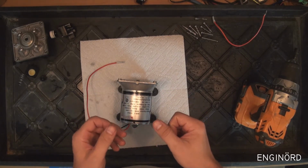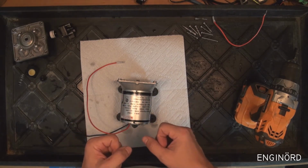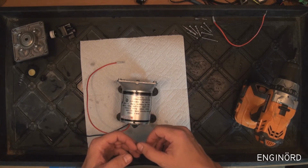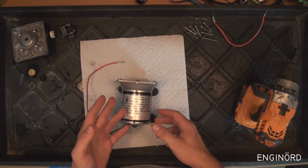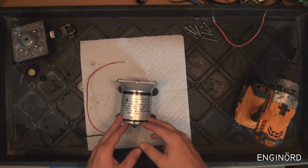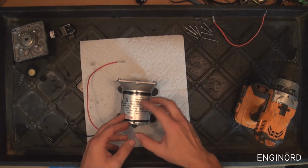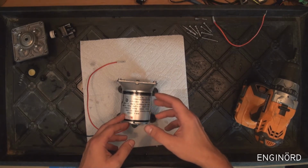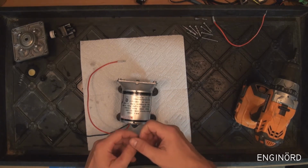I've heard some people applying compressed air. What we're going to do next is do a couple tests, and we're going to look at how that compressed air is getting rid of the water inside. I have doubts about it, but we'll see. Some of the RV places will run antifreeze, and there's a special antifreeze you can buy in big box stores to put into the RV. Do not put regular antifreeze into the RV system, because it's poisonous. There are special RV antifreeze formulations that one can buy in big RV stores, and use that if you want to winterize your RV at home.